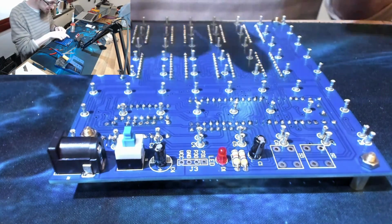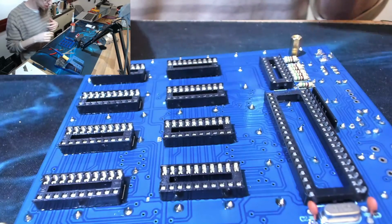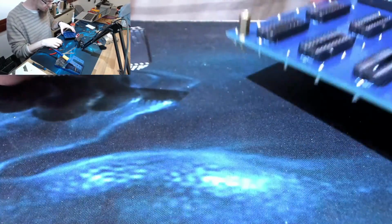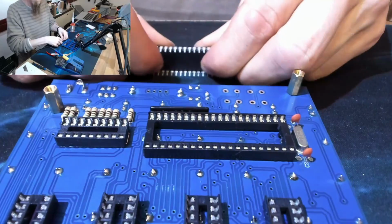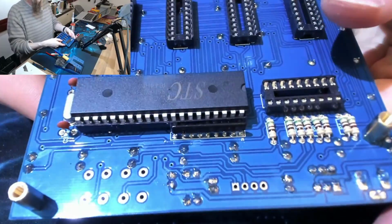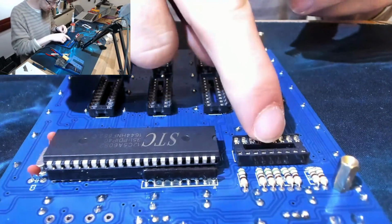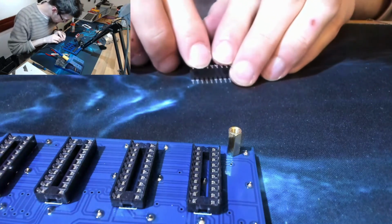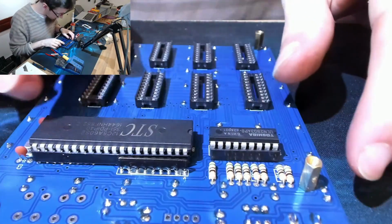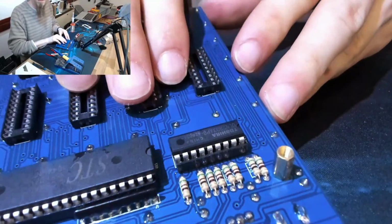Cool. Right, so theoretically, if I stick some LEDs in here and give it some power, it should light up. I'll rephrase that, when I've put in some ICs. So let's drop those ICs into place now. Start with the big mama. So I need to bend these pins slightly so it'll fit into the socket. Let's do the others. So we've got a shorter chip from my Selectorama that's going to go in there. Let's just give this the leg bending treatment as well. Half moon, half moon. In you go. Press that in. That's in. Nice.